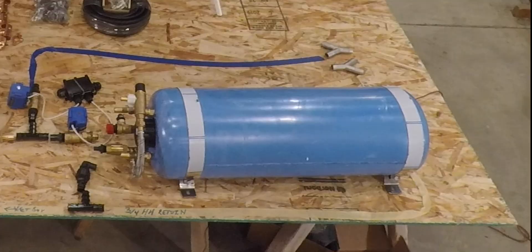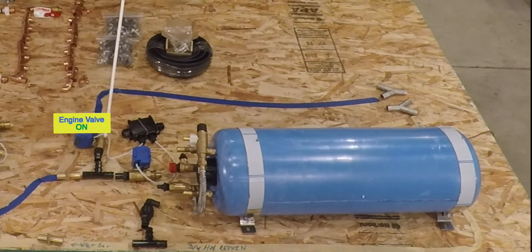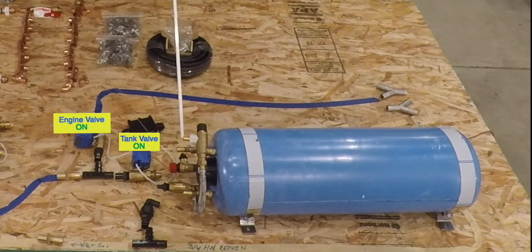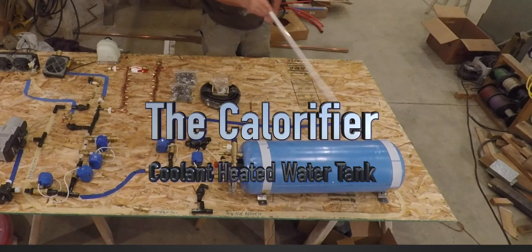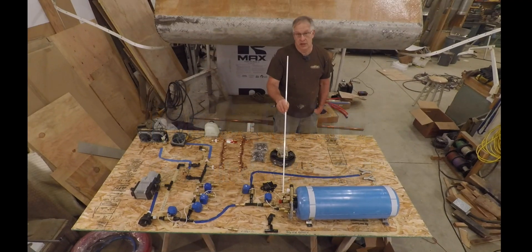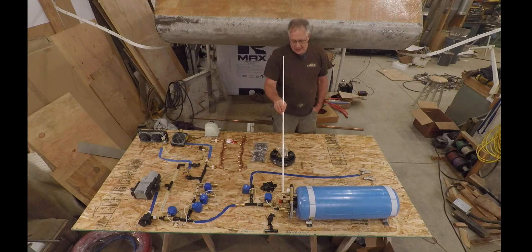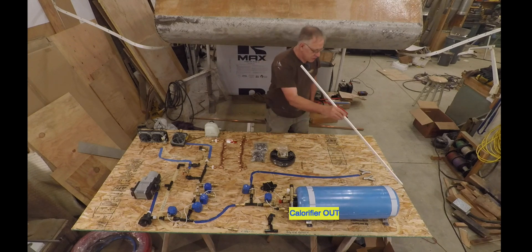So we're going to collect water from the engine as it runs and route it through here. This is the engine valve. When the engine valve is open and the tank valve is open, hot coolant will go through those two valves into the calorifier entrance right here. These two pipes on the calorifier are a coolant loop inside of it - there's a spiral of copper pipe inside which transfers the heat from the hot coolant that goes in. Coolant will circulate through this at about 180 to 230 degrees, heating the water inside, then returning out this line - going in hot here, coming out cooler, through a piece of 5/8 inch hose to the branch into the return path, and circulating back to the engine.